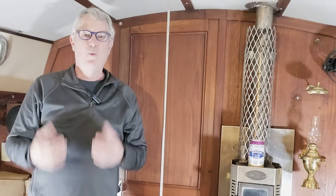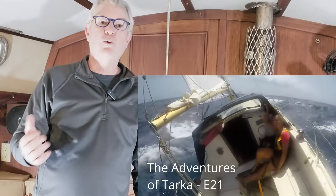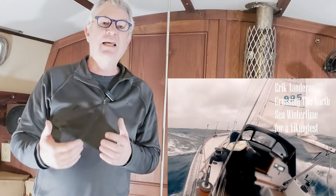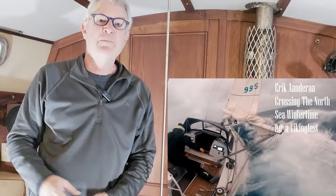The scenario is all good in theory, but it doesn't cover everything entirely. It's not often that wind will just happen in isolation. When wind increases, so does sea state, and that in turn subjects the sailboat to increased involuntary movement in the form of pitching, rolling, yawing, and heeling. This extra movement means that the wind forces are not exerted with a continual force, but can instead be exerted in an oscillating manner. The boat can roll or pitch in ways that decrease tension on the rig, and then right itself to a position that re-exerts the load. This pumping of load back and forth as the boat pitches and rolls in heavy seas can cause increased structural strain on the sailboat, and might be described as the sailboat breathing or panting as the load is exerted and eased.